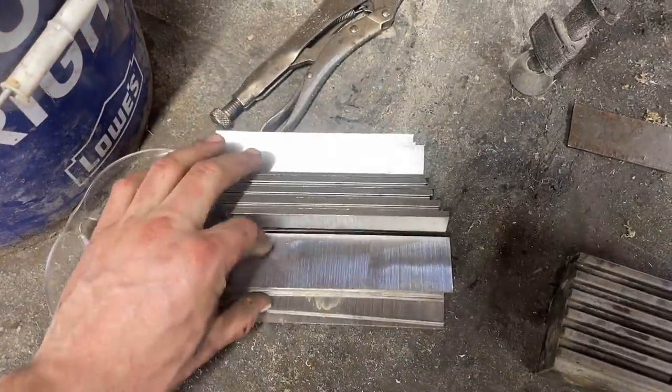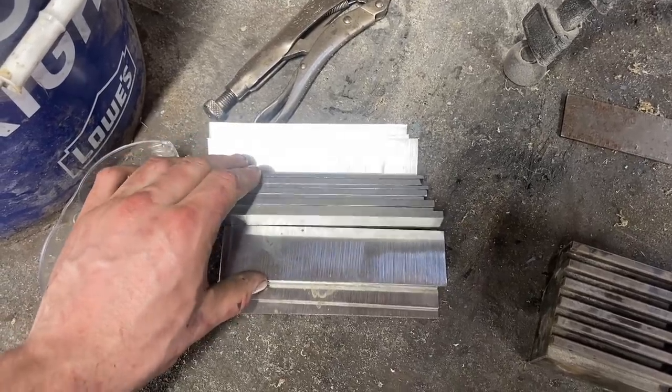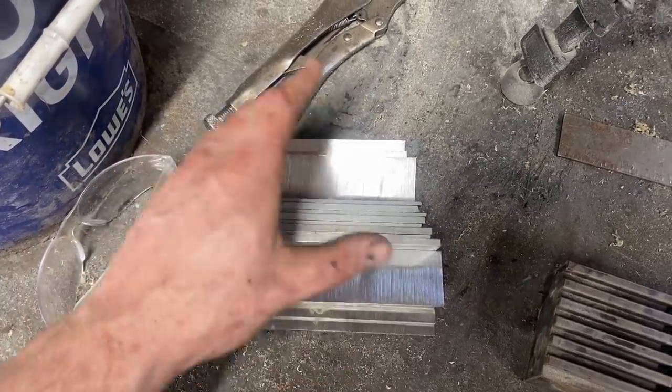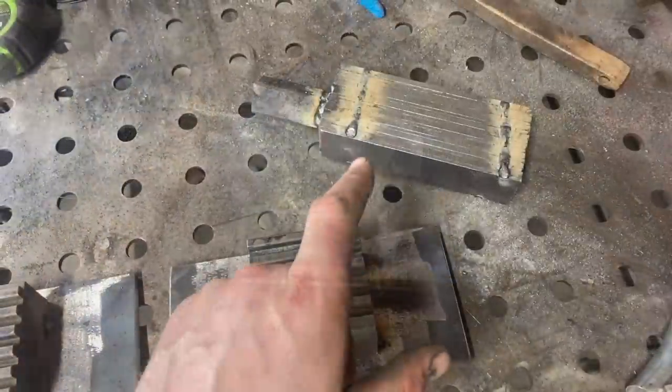As always, our first step with Damascus, we've gone ahead and ground all the mill scale off all the pieces so we got nice clean welding surfaces. But we'll tack this guy together with the welder, weld the work peg onto it. I mean, there really ain't nothing to it. We got our billet tacked up. It's looking pretty good, just about ready to go in the fire.